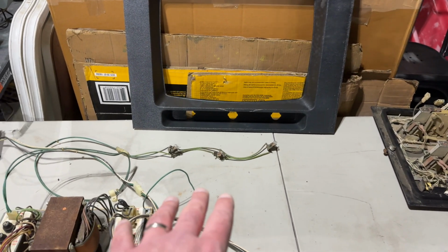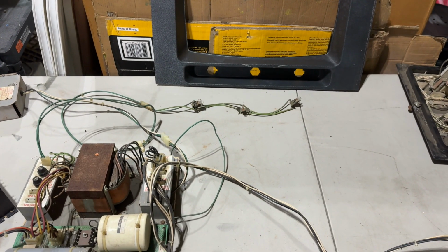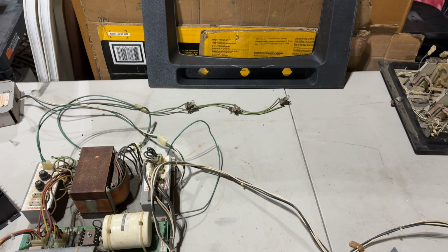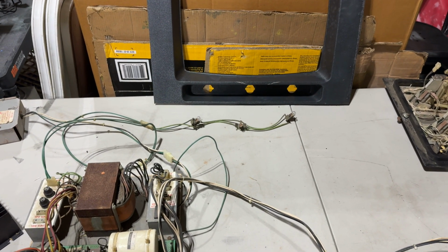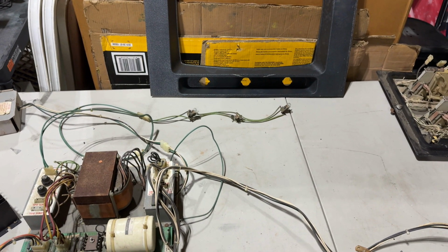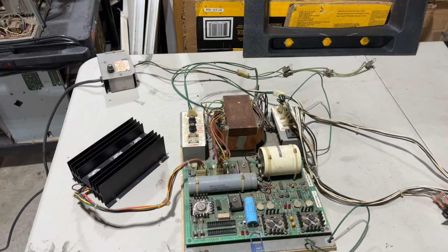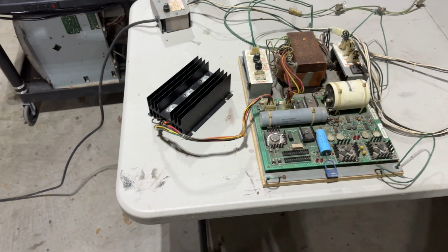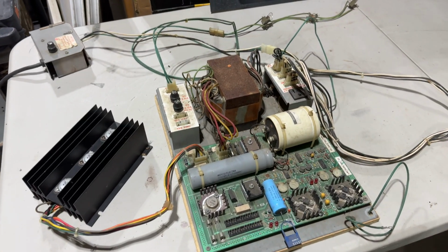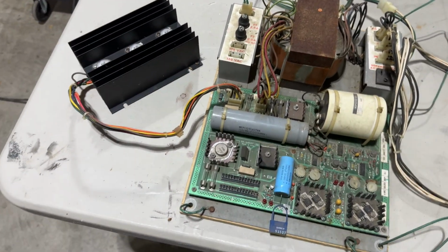So I robbed 3 of the lights from the marquee light and put them into those bayonet holders, and I tested them with my multimeter, and they all have around 4.5 ohms of resistance on those bulbs, so I think they're okay. So hopefully we'll see at least those 3 lights light up. Maybe we'll see these LEDs flash again. Maybe, I don't know, I haven't gone back and looked at the footage yet. Maybe we'll see the 2 amp fuse fire up.